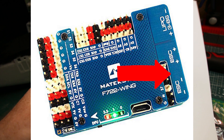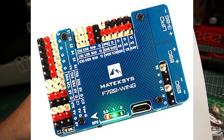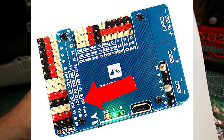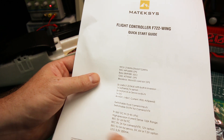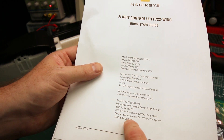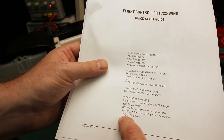Software serial, two motor controls, six servo outputs, one I-squared-C data line, four analog to digital converters for different analog inputs, switchable dual camera inputs — so we can have two cameras into one VTX, switchable. That is super awesome. It's up to 8S LiPo, so it'll take right up to big batteries. An adjustable BEC, so we can do five amps for the servos on a five volt, six volt, or 7.2 volt option, which is super cool. Low dropout 3.3 volt, 200 milliamp LDO on there.